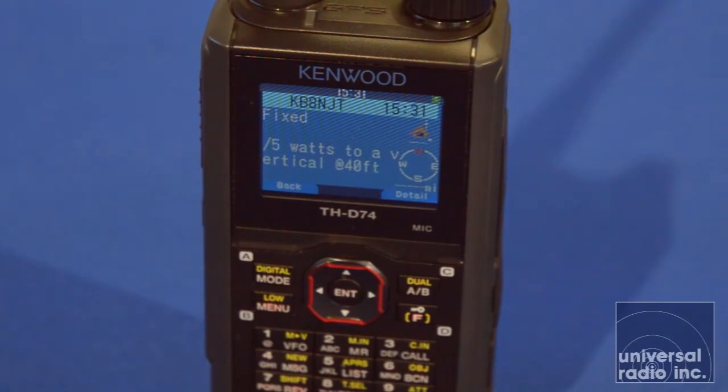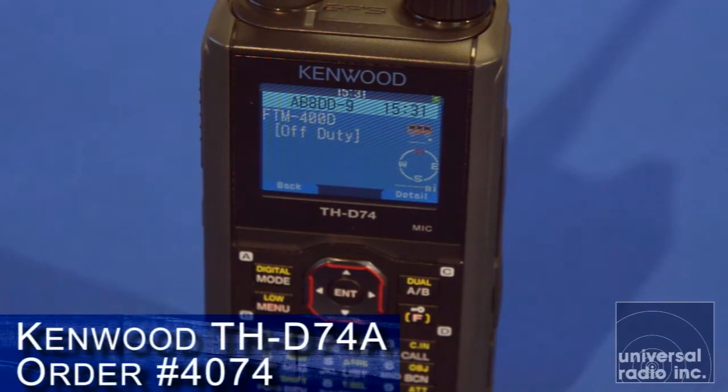You can monitor on the 2-meter band the APRS frequency, and as it's going right now in front of me, it's decoding and picking up packets that are in our area. Definitely an innovative handheld having all of that integrated into it. One thing that's really unique is this Kenwood is capable of working on D-Star, which is ICOM's digital mode. This is the first radio I've seen in the market that's able to work on that system that's not an ICOM — so that in itself is a really groundbreaking feature. When you look at the ICOM radios, none of them have an APRS modem built in. So while they can do the location stuff for the digital mode, it doesn't play well with APRS — and that's something that this radio does that no other radio on the market has available.